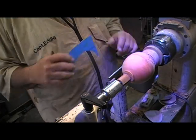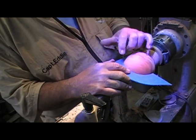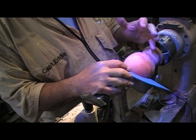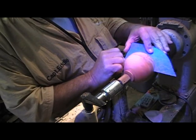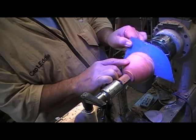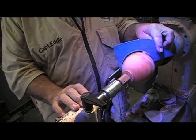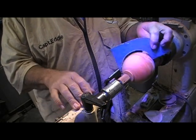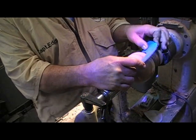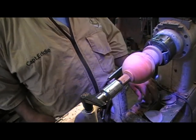The gluing's been complete for a couple of hours now. Got a little sidetracked. I know that the globe on this side, the first one, was much more uniform than the one I turned on the back side, because I can see that there are some irregularities. As you can see, when I go around over here, I'm standing proud in a couple of places. So I need to shape this out, and I can see it just by looking at the template over the top of it, where I'm a little bit thick. So I'm going to begin to shape this up.